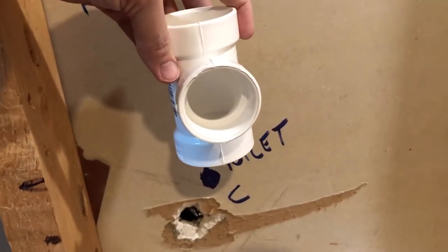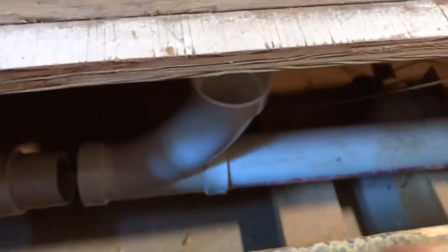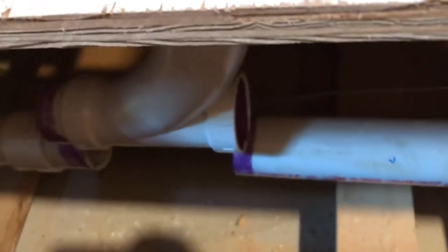I'm going to cut the 2-inch piece that goes from here down to there so I can have it in place when I'm putting in this sweep, just so I can make sure it's turned right as I glue it in. I've got primer on all my pieces where they're going to connect, and I've glued in a little piece there. The piece is glued in, and my sleeve is in place in the pipe so I'm able to slide that over. I wanted to go ahead and have the 2-inch piece on here just to make sure it lines up with the hole - it's not glued in yet, but I did want it in there.